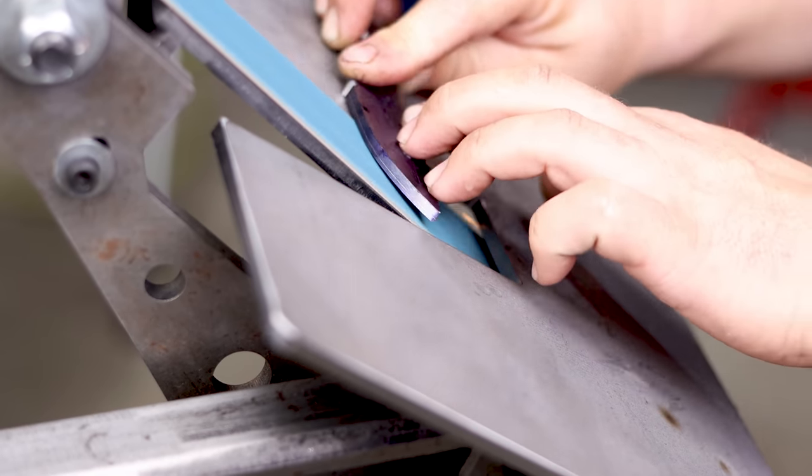These are rough grinds but you can see already how close those grinds are. You see these scratch marks here because this is pre-heat treat and I haven't done my finished sanding. These scratches don't bother me, but when you get to doing your finish work post-heat treat, what I found really helps in keeping those scratches down is get some electrical tape — I use two-inch wide electrical tape and run it right up to the bevel. Because you're putting all your pressure against the handle, you don't need to run that tape all the way up, but that layer keeps the blade off the True Tilt work rest and keeps those scratches from happening.